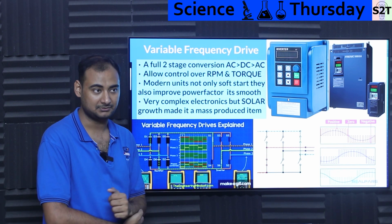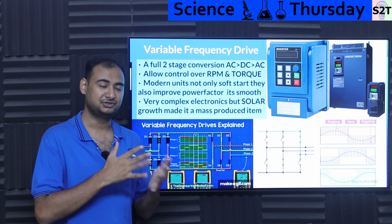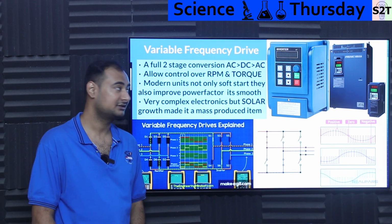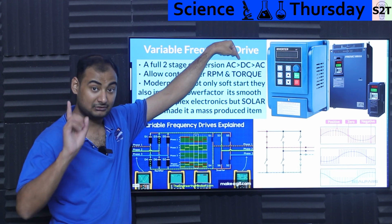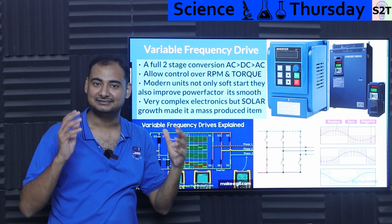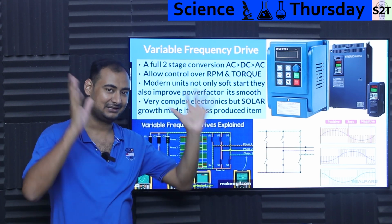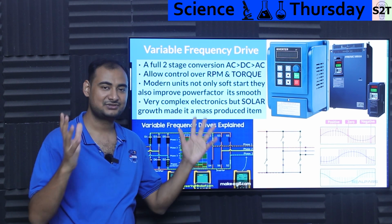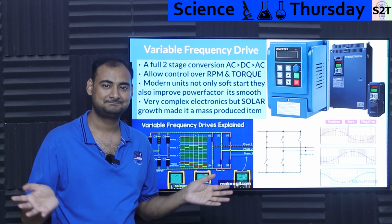That shall have good water pumps. A water pump consumes a lot of power, so you need a lot of solar panels. But giant inverters and giant batteries to run a pump would be too expensive. So somebody figured, hey, we have DC to AC that runs the motor. What if we give the DC from the solar panel directly here? That's how we are running basically all the water pumps in India, solar water pumps. So they have a solar panel, VFD, motor, no batteries required. The sun comes up, it automatically drains the solar energy, and no problem.